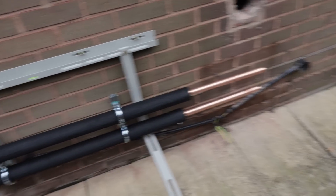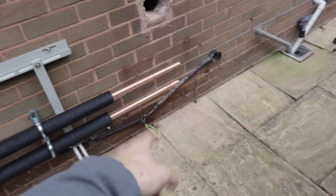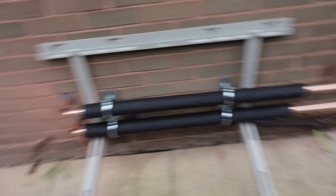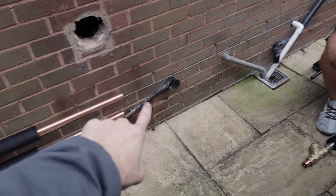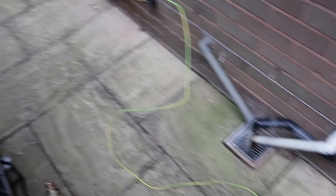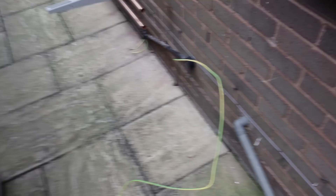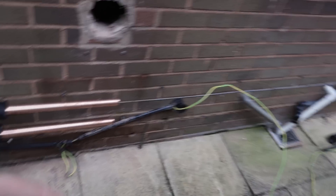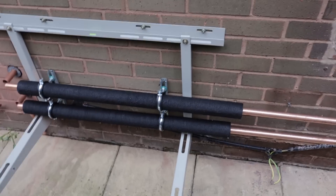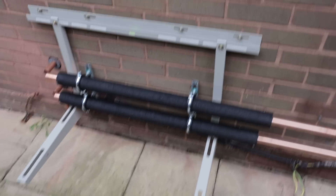That used to be on an oil bond which is getting capped off. I've got two new end boxes, some conduit, two elbows, and all the tools out of the van. I've pulled out the earth wire from the fuse board — obviously I isolated the supply before removing the supplementary bonding, or main protective bonding, whatever you want to call it. Now I'll rip all this conduit off and start from scratch — should be a nice simple job.